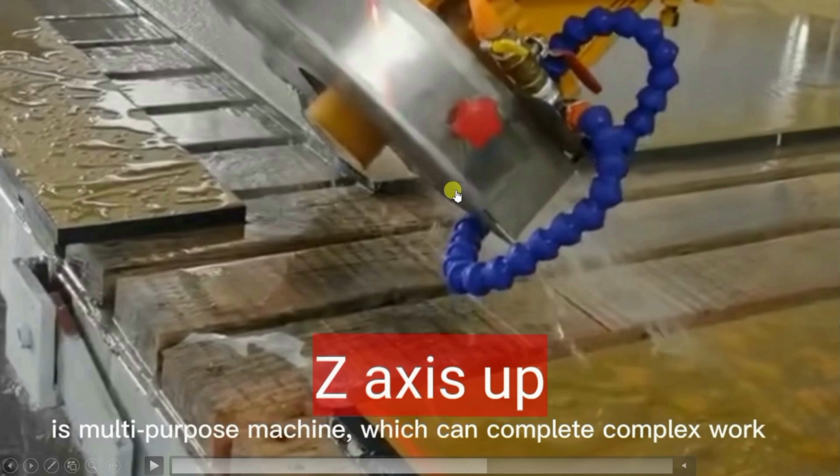So in the PLC logic we will write, store the pulses coming from the encoder. We will count the pulses with a high speed counter. Then we will compare the counter value. If the required distance is achieved, that means if the required count of pulses is achieved, based on that we will give reverse and forward commands to our servo drives. So this is how the programming works.